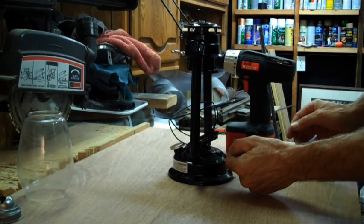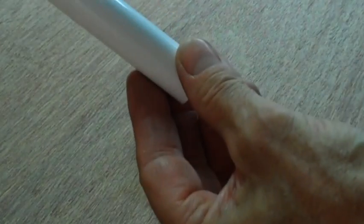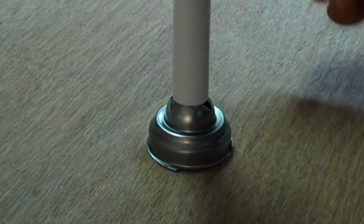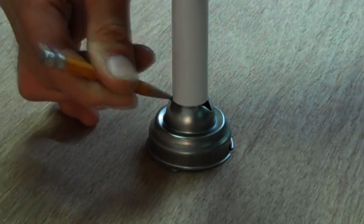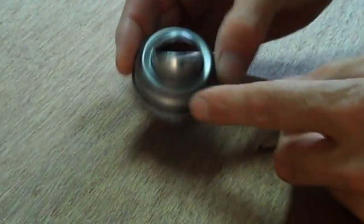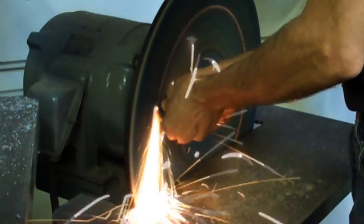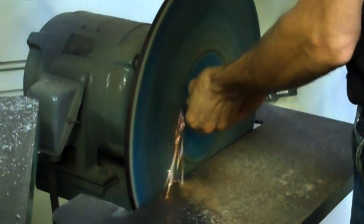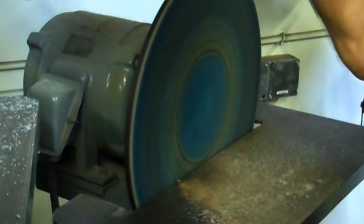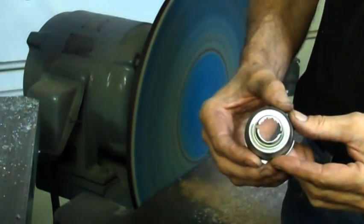There's an inner and outer layer that you have to go through. Once this is done, take a file and clean it up. With your socket cover, pencil-trace the circumference around the wick dome. This will show you how far you have to sand and remove this portion. So we're going to sand this away, and then the socket cover will fit into here. If you don't have a sander, ask a friend, neighbor, or a local machine shop to help grind this part for you. Now it's round — all we have to do is de-burr it by filing, and it will be ready.